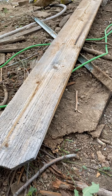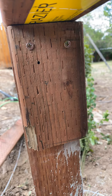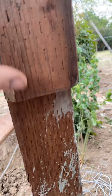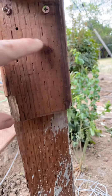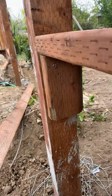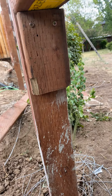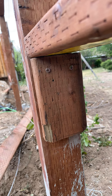240 minus 8 is 232. I'm doing a method — not sure what it's called — using a rectangle board underneath instead of brackets. I'm putting in two screws here and then two down below. With a 2x4 up here, that's four screws in each of four little panels, which are just six inches roughly sawed off from a 2x4.